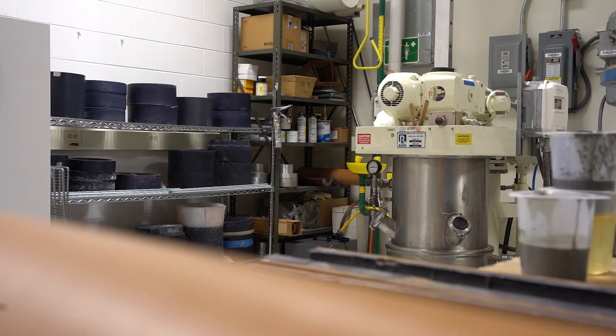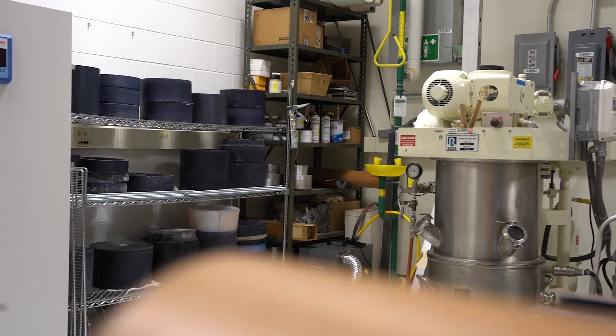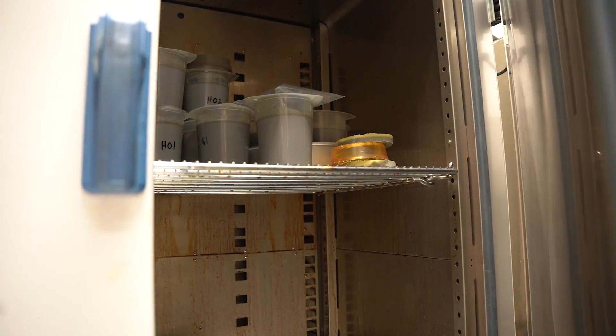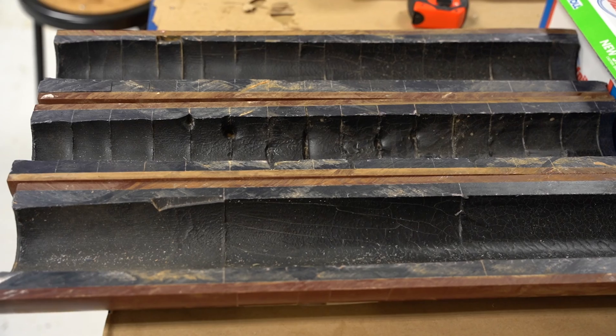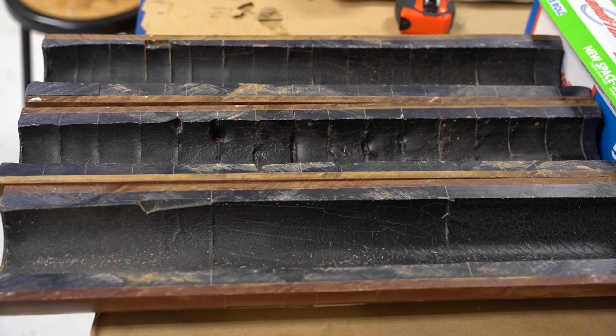Later on, we realized that if we developed and processed it here and then took it to Mars and it got down to minus 40°C, it would be pulling away from the cartridges and away from the cases. So later, we started chilling the grains — the wax segments — and inserting them in the cartridges in a freezer. We would slide it into the cartridge and motor case so it was shut tight at those temperatures. The motors that were tested that way worked very well.